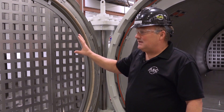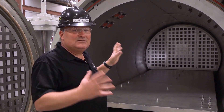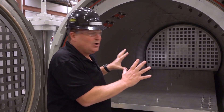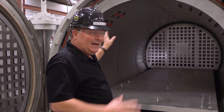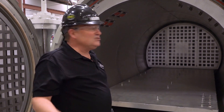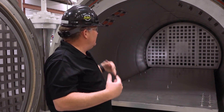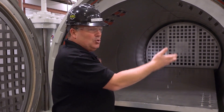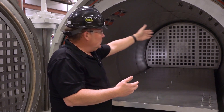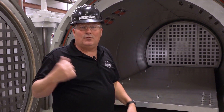That H-slot concept is also moved to the back of the autoclave, where we end up with a secondary H-slot panel. That is also designed to allow distribution of air down the entire length of the autoclave, at which point the air goes into the H-slot at the end and converges back to the fan. In a conventional autoclave there is a square opening at the back and the air converges to that square opening, leaving blind spots in the rear corner regions. This means that tooling placed in the front or rear corners of a conventional autoclave will end up with poor airflow — in the Econoclave we've basically solved that.